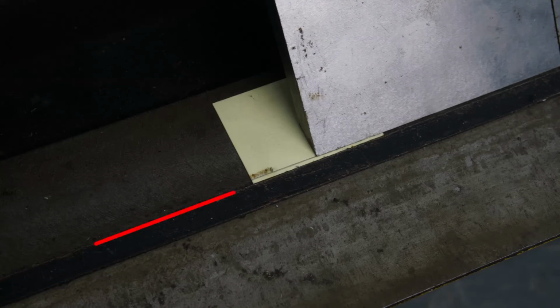The red line is the hinge line. The yellow line is the tip of the chisels. I've adjusted the brake so that the hinge line is offset by 1/25 of an inch from the front of the tip. That's the thickness of the aluminum sheet. Position the sheet so that the center of the bend is coincident with the tip, not with the hinge line. The pencil line on the yellow piece of paper is where the center of the bend will be.